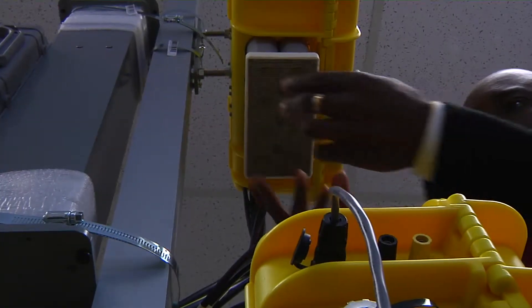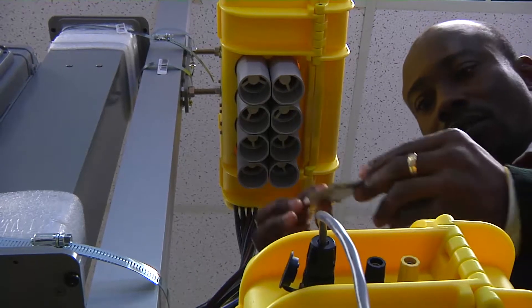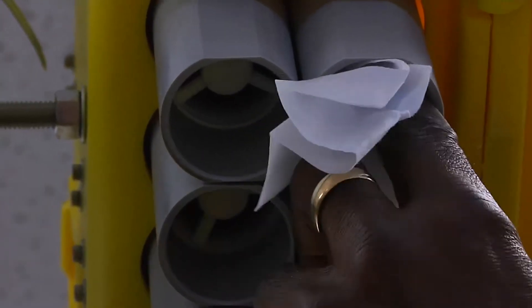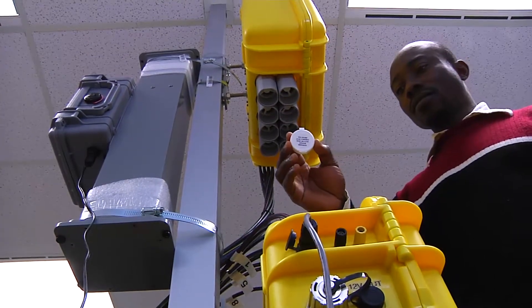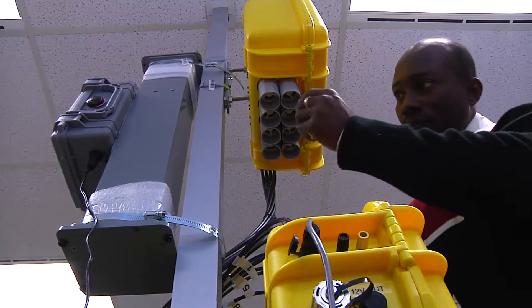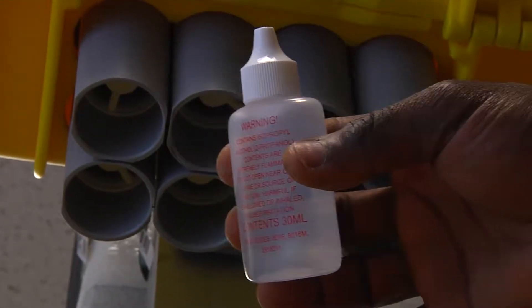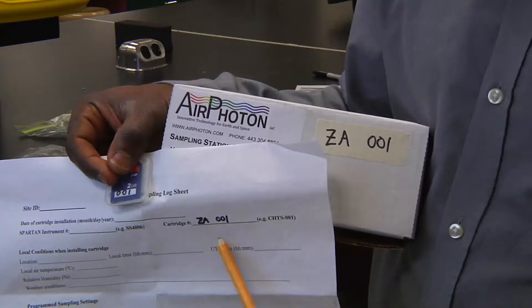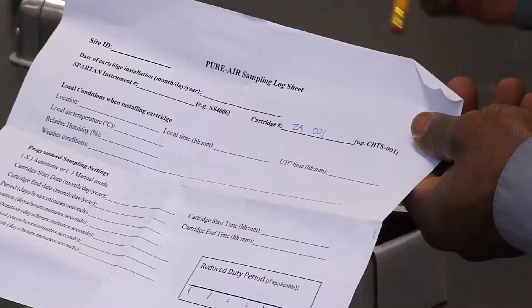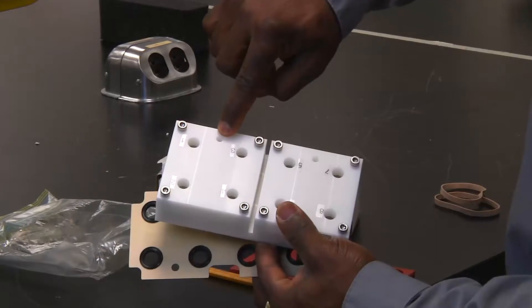Before you install a new cartridge, you must clean the impactor plates. Open the base of the inlet box to expose the impactor plates for cleaning and oiling. You also need to put some mineral oil on all 8 impactor plates. There are gaskets, a sampling log sheet, and 2 memory cards in the cartridge box. Check that the number on the cartridge box matches the number on the log sheet.